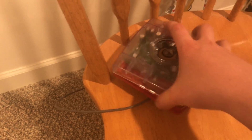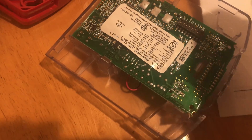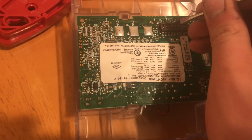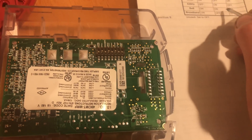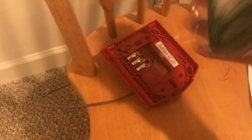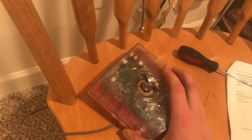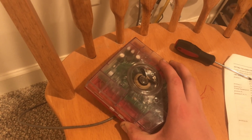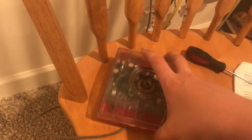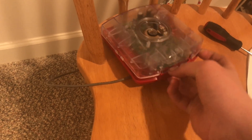Now let's actually try 520 hertz. Switch five needs to be off, switch six needs to be on, and switch seven needs to be off. Okay, now we can do 520 hertz. That is just straight 520 hertz.